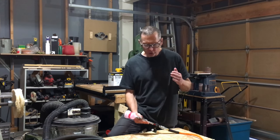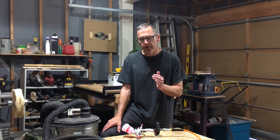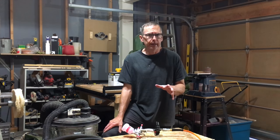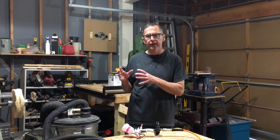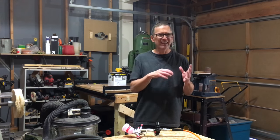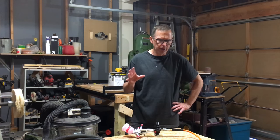As far as what I would recommend — it's a little different than what I'm actually using, but not by much. For an air system I would recommend a compressor somewhere between one and a half and two horsepower with a 10 to 20 gallon tank. The bigger the better, because with a larger tank you can run other air tools as well. A lot of times when compressors are on sale the price difference between a 10-gallon and a 20-gallon is very minor, so go as big as you can.